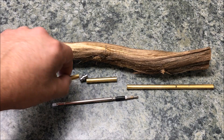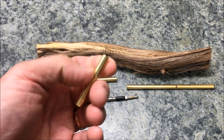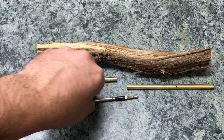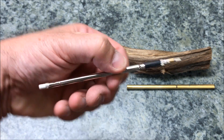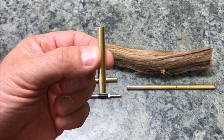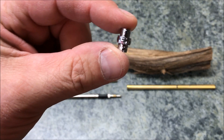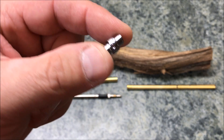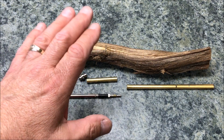Making a modified mechanical pencil is a little more difficult than making a slimline pen. With a slimline pen, if you barrel trim away a tiny bit of your tube it's not a big deal because you've got some play in the mechanism. With the mechanical pencil you are locked into a fixed length, and if your tube is too short this just isn't going to fit. So we measure the length of our tubes — each of these tubes is exactly two inches. We've got four inches total, and then we have to take into account the chrome ring, which is one eighth of an inch. So we need four and one-eighths of an inch for a tube length.